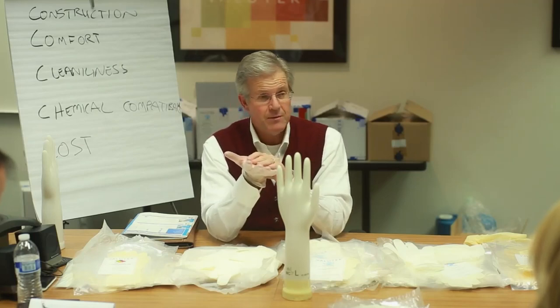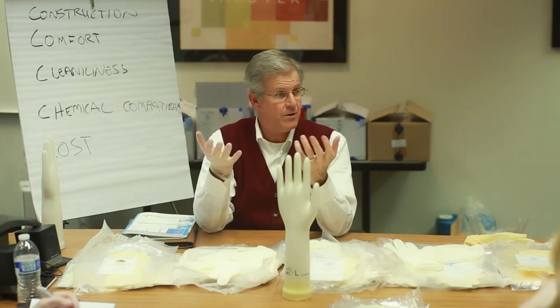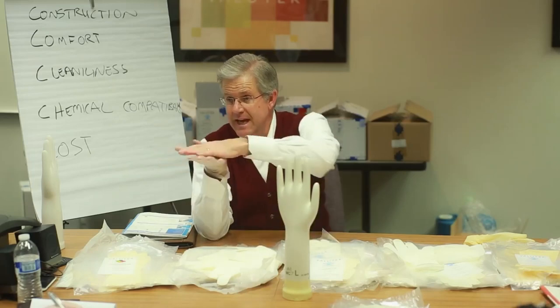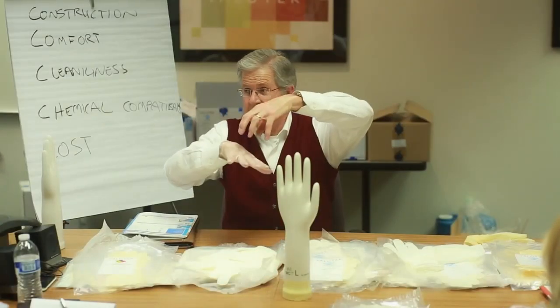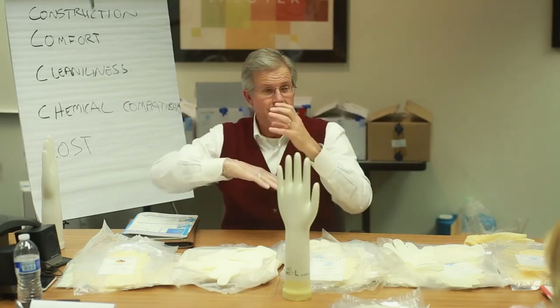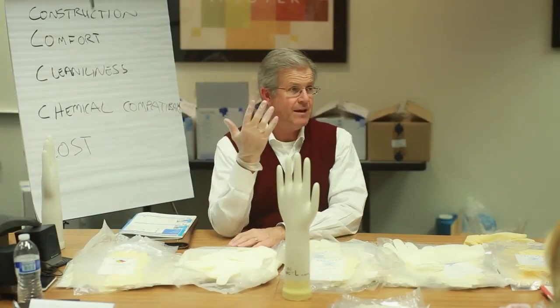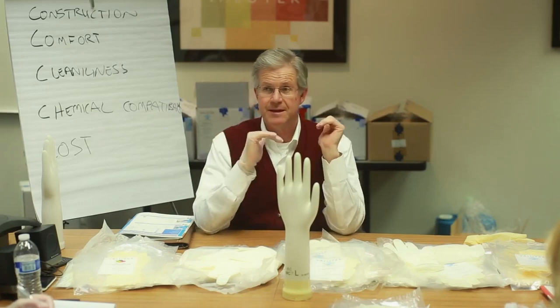The PVC glove doesn't go through a vulcanization period to case-harden it, so at the molecular level it is very porous — similar to how cotton and polycellulose wipers have an open structure and tend to lint but are more absorbent. Because it hasn't been vulcanized, the PVC glove is very bad around chemicals; chemicals can and will seep through with certain chemical exposure. The glove will start to get warm, it will bubble up, and operators will take it off to rinse their hands. PVC is clean but only in a dry process — with prolonged chemical exposure, particularly IPA, it will not have chemical compatibility.